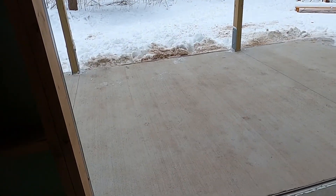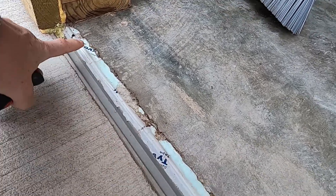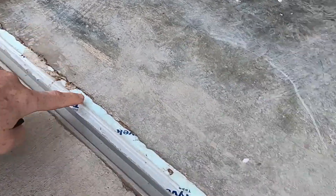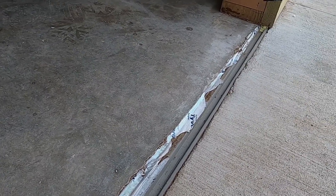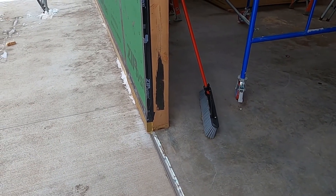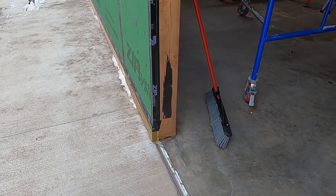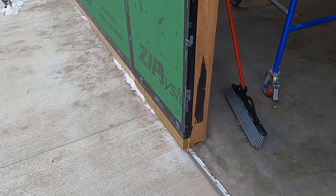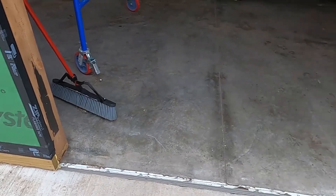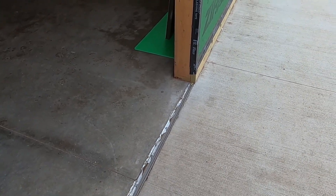What we have to do before then is prep and flash the sills. This is a strange sill because of that grade board — we have a pretty hefty trough. Also the concrete, because it's on a 45-degree angle, is exceptionally thin up here. We've got some self-leveling polyurethane to fill this crack and protect it before we flash the surface. I'd like to use a sill pan but can't find one that works, and I don't want a solid metal sill pan due to heat wicking. I'd like to use liquid flash, but it's too cold for that.